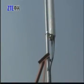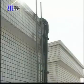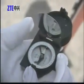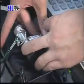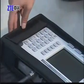Checking and testing the antenna and feeder system. When finishing the installation, check to ensure connectors are tightly connecting feeder cables and jumpers, the lightning arrester installation is reliable and correct, all screws have been fixed tightly, and waterproofing is reliable. Check and measure the azimuth angle of the antenna. Check the voltage standing wave ratio (VSWR) of the antenna and feeder system. If not eligible — typically less than 1.3 — then check the joints or continue to check the performance of the other parts.